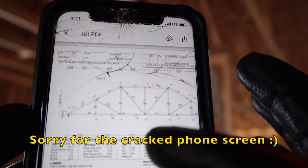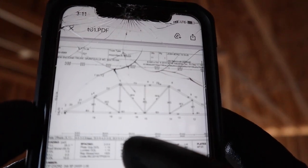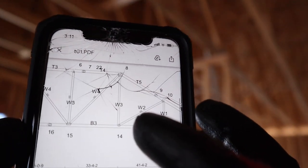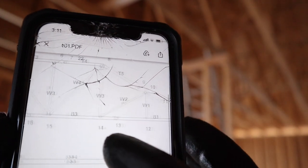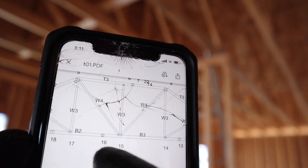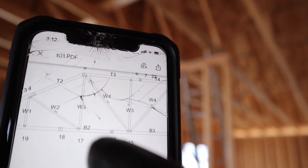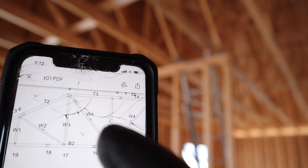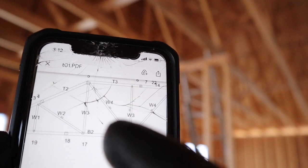If you're wondering how do I know where to brace these at — here's the truss details on my phone from the truss company. If you zoom up here, you see that little square, that W-2, that's a brace going across. And you can see there's a brace, there's a brace, there's a brace, and right there's a brace. So what you got to do is just run two-by-four straight across. I already got these in here — they're just two-foot blocks, but I'll show you those.